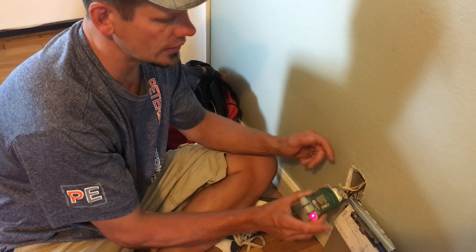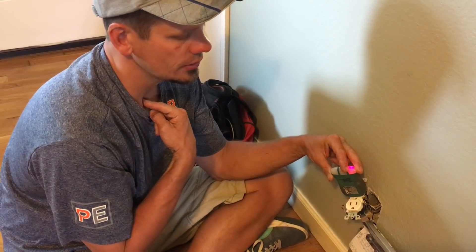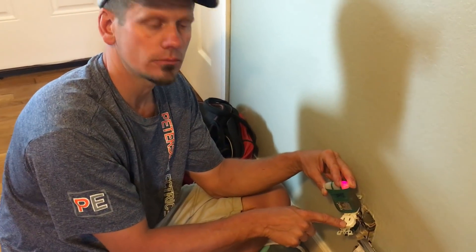So again, if you do have that, you're supposed to go back to a two-prong plug. And in my opinion, I have personally never seen a two-prong plug tamper-proof rated without it being a three-prong at a 15-20 amp operating — especially for a dwelling, a residential.